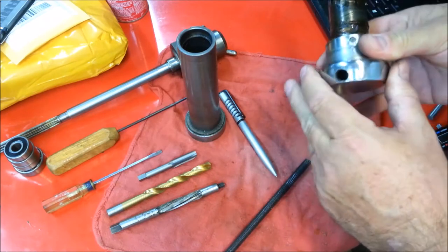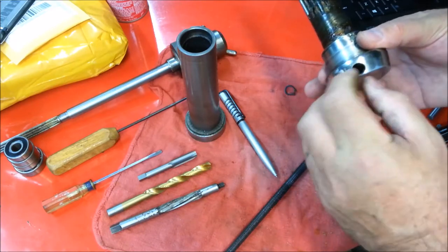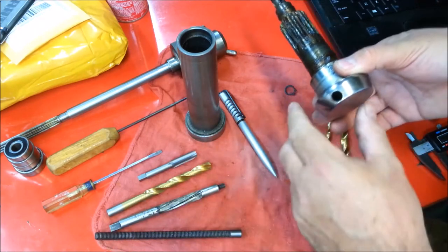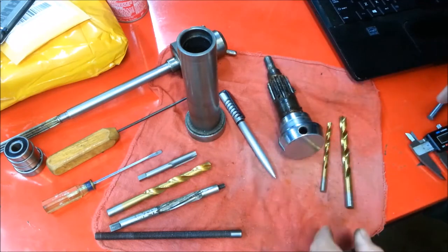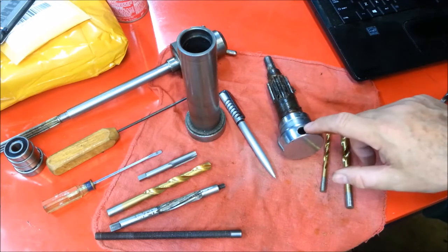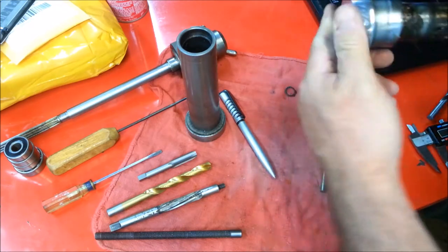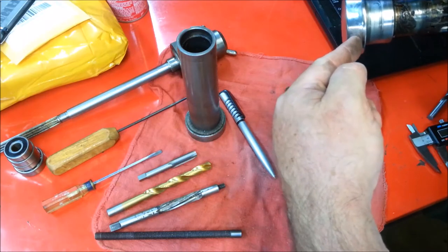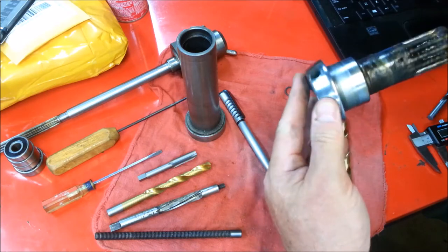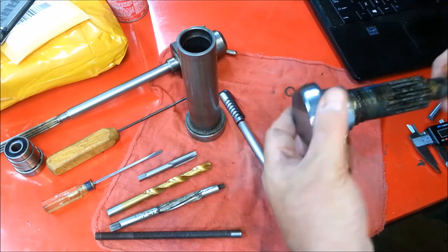All three of these holes are ruined. I've got two similar drill presses, and they have seven-sixteenths shafts running out to the ball. I ordered a piece of half-inch stock, and what I plan to do is tap this to 11 millimeter — 11 by 1.5 millimeter thread. I'm going to do this on the lathe so that I can get the right angle, and I can use the holes in my bull gear to index this so that everything is positioned just right.